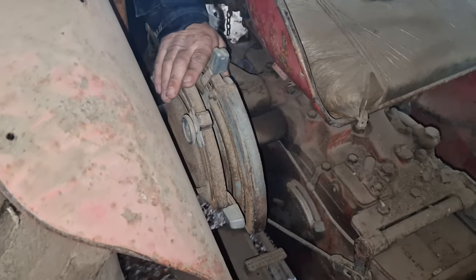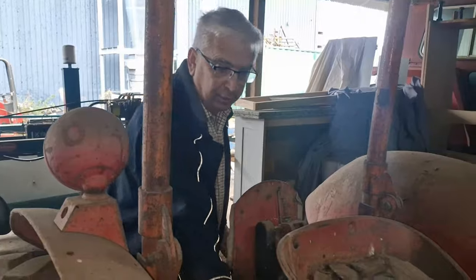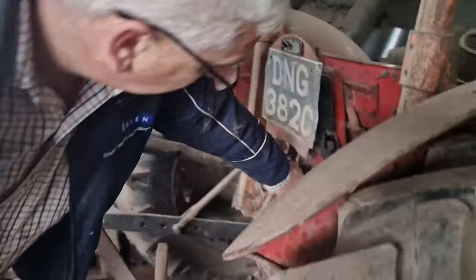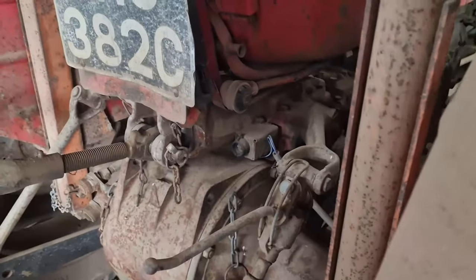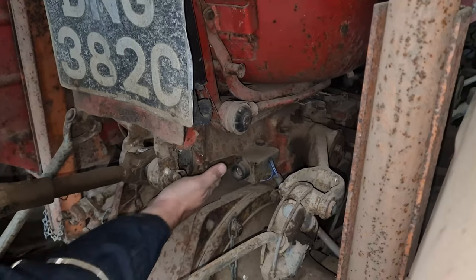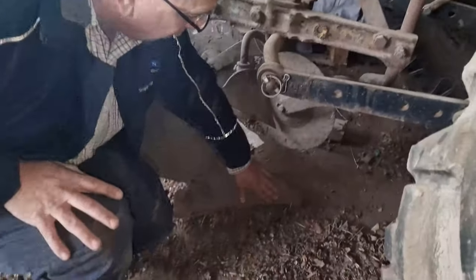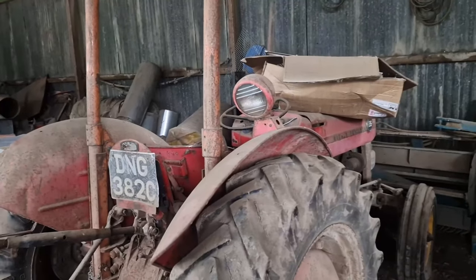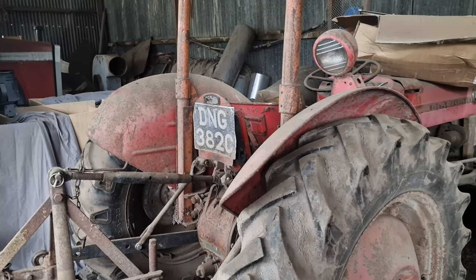Does that look familiar to what we've just seen in the very much later tractor? Exactly the same. You've got the pressure here and draft on this side. So this is a 1960s tractor and that's a 1980s tractor - doesn't that look very similar, if not the same? Because it's working very similarly, but at slightly different scales. You can just see the rubber's broken on the piston - there's your piston in that chamber there, sensing the oil pressure. The plow is trying to bury itself in the ground, and we're lifting that and putting that weight onto the wheels to give you grip. That was the whole purpose of the Ferguson system - to transfer the draft of that plow into the ground, hold it up, and put it onto the rear wheels of the tractor. Therefore you didn't need a big heavy tractor to pull a lot more. It's called weight transfer.